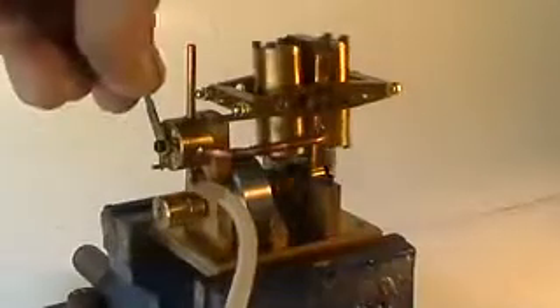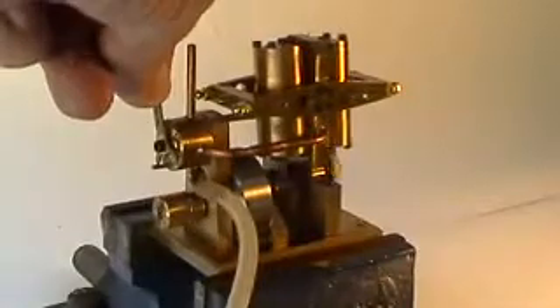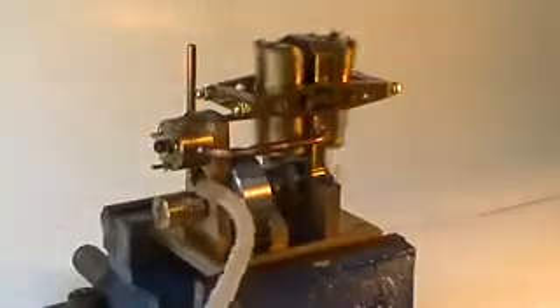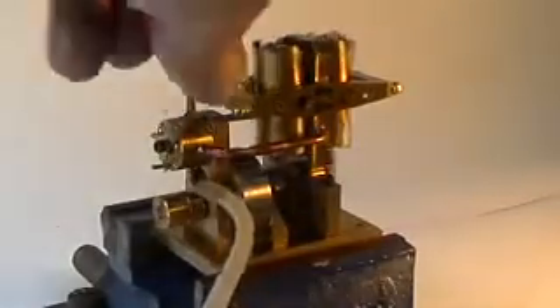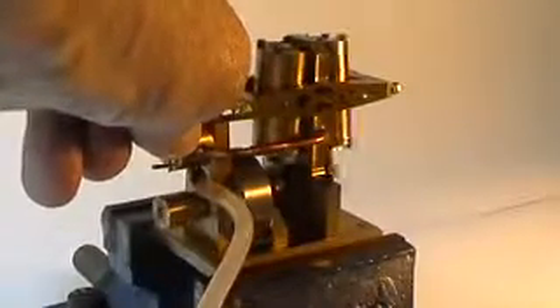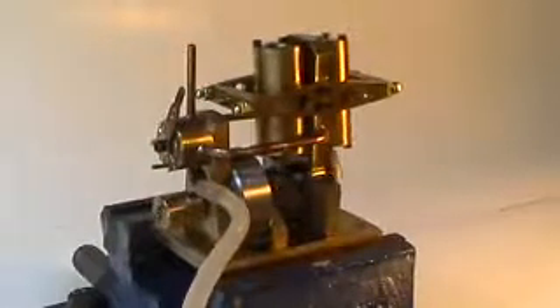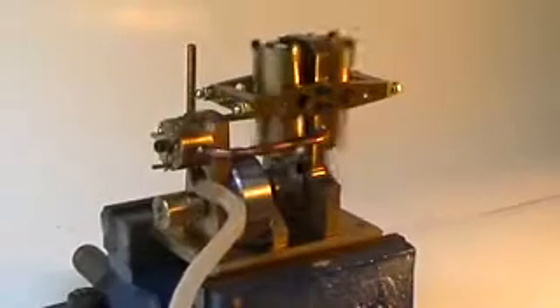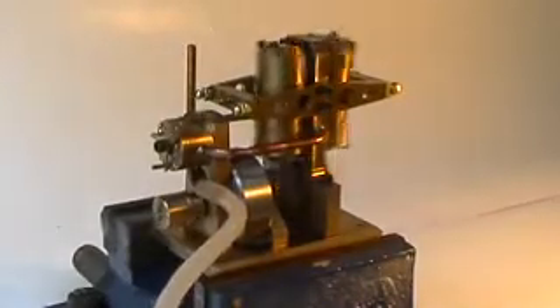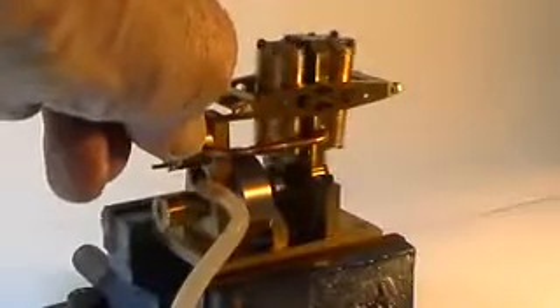Here it is running at last. I'm making a slight adjustment to the throttle reversing valve, bringing it to the middle — it stops — right over to the other side, full speed ahead. At the moment it runs very slightly faster in this direction, because I have to make a permanent small adjustment, which involves disassembling the throttle valve and making a permanent adjustment to the relative position of the valve drum with the actuating lever.